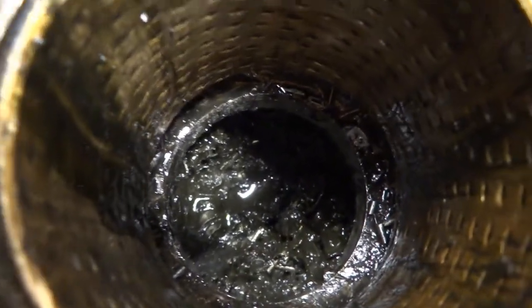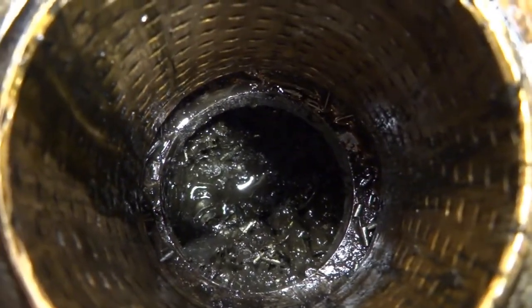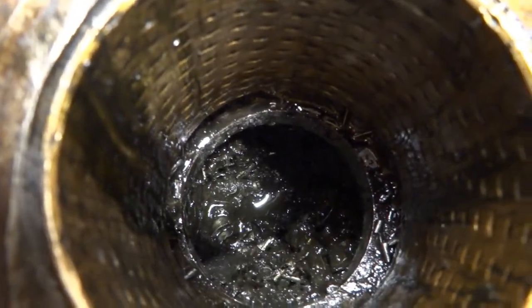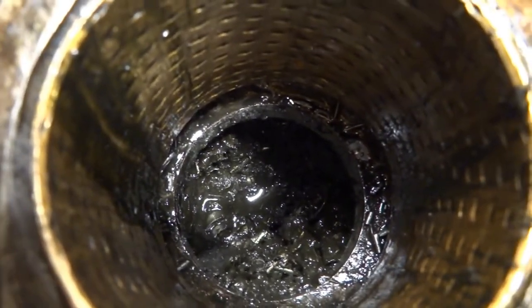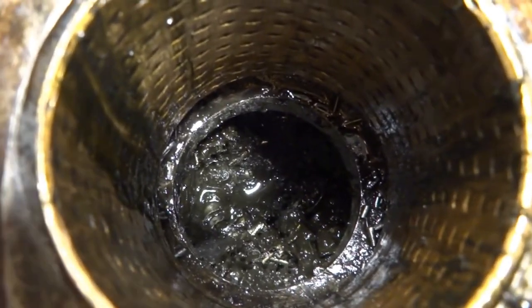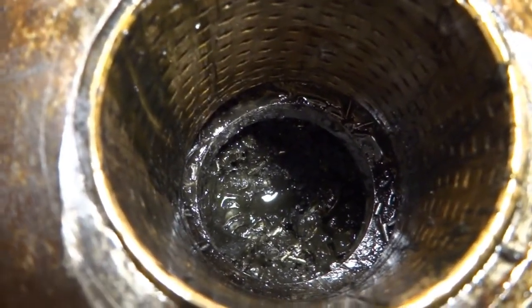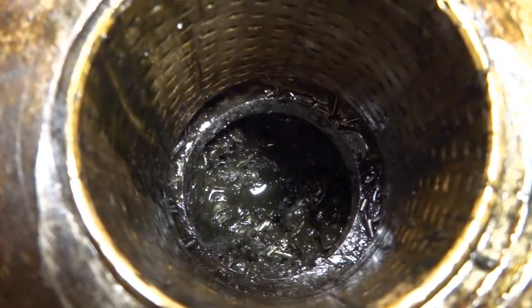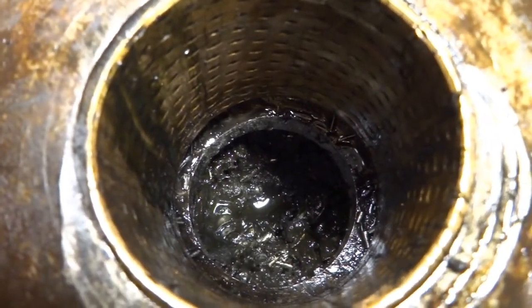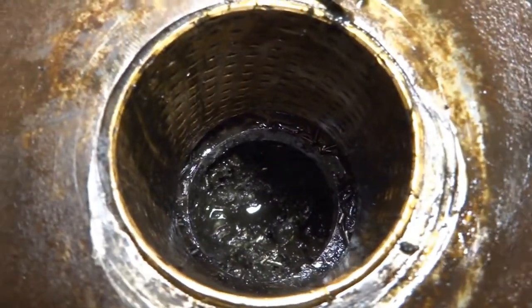My plan was to put the boring head in and just keep opening that up until it was bigger than the pin that has to pass through there, but that's going to be pretty slow work. I realized that if I just flip it over and drill the other side the same, I can push all this grease out — which I have to do anyways — and then I'll just get my father-in-law to burn the rest of it out, just like he did on the other half, and that should be a hell of a lot quicker. Anyway, that ends the machining on this part of the bucket. Thanks for watching.